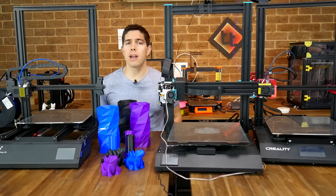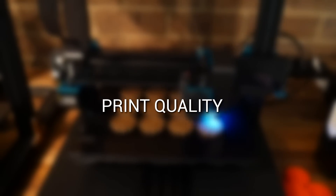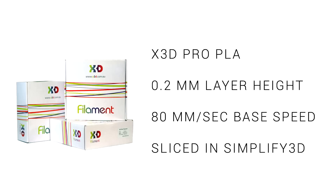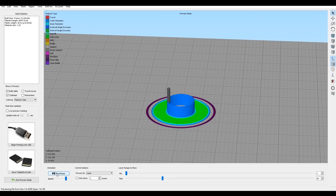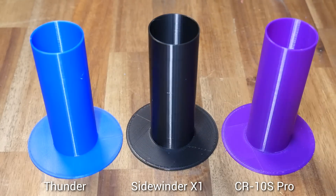It's worth mentioning that all three were easy to unbox, assemble, and be printing in a short amount of time. I can say upfront that all three printers produce really nice print quality. In my initial reviews, linked in the description, you'll get to see more, but for this video I've done three distinct test prints for comparison. They all use X3D PLA filament at 0.2mm layer height, a base speed of 80mm per second, and are all sliced in Simplify3D. The first is a cylinder test — it might look like vase mode but it's not. Each layer is built on top of the last, making it excellent for checking Z banding, and the results from all three printers are absolutely perfect.